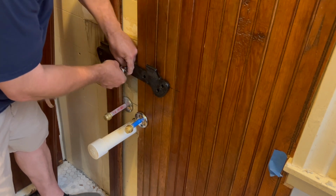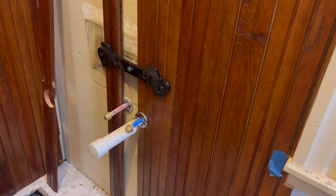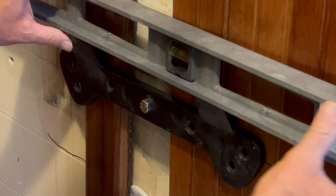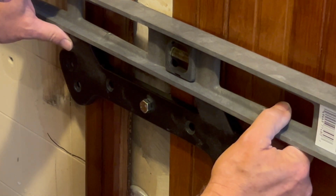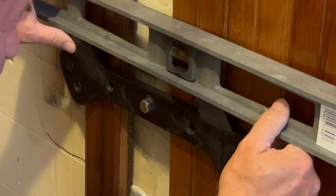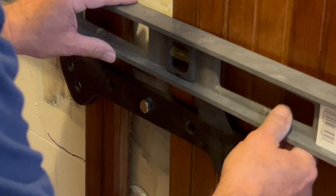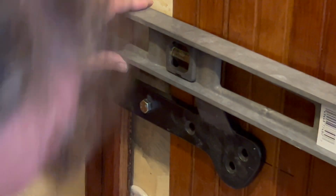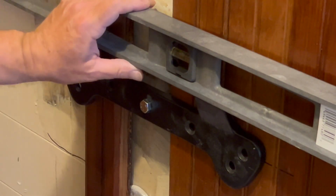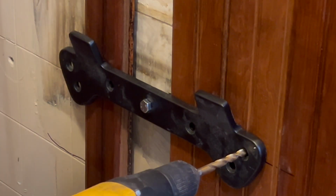We're reusing this 1930s sink in the same location. In order to properly install the bracket for the sink, the precise holes must be cut in the wainscot. Since there were already holes in the plaster, I used the bracket itself as a template to locate the holes in the tongue and groove pieces. As you can see, I used the wainscot as a spacer at the same time, while I bolted the bracket to the wall and then drilled the holes one at a time as I went.